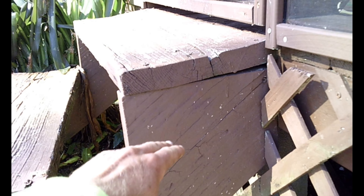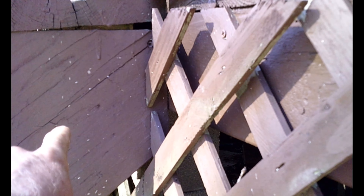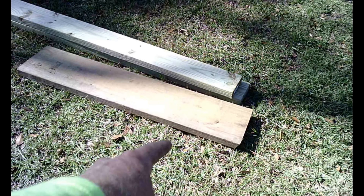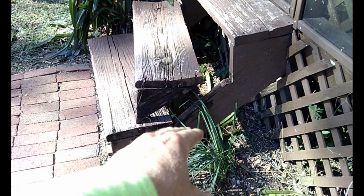We're gonna tear these out and put two steps in, because there's no sense having three steps — this third one is at the deck height, so we might as well come down a step. The stringers are attached to this two-by-six framing of the deck and there's nothing down lower to hook them to. So we're gonna put in a tall post for the handrail and a shorter post, with a board attached between them — that's where the new stringer ends will attach. Then we'll get to time-lapsing, tearing this out, and making a new paver spot for the bottom of the steps to sit on.